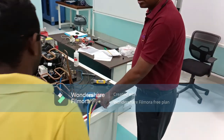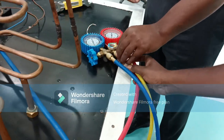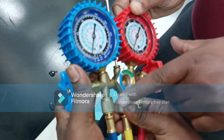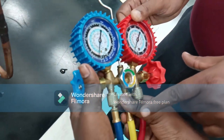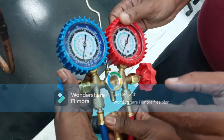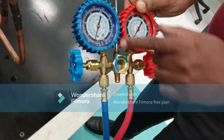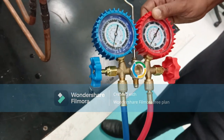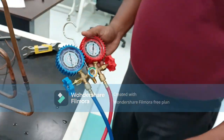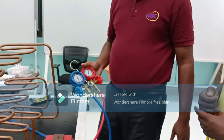You can open this hose — show it, Krishna — this middle nitrogen hose. Just show that 25 psi will be retained because the valve is closed. The pressure here is 25 psi. I think a valve was open and some gas was being passed out here, but the pressure in the system is 25 psi.